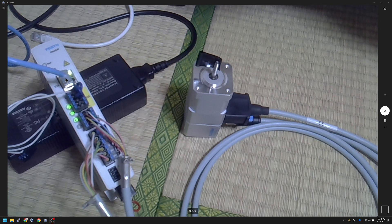There is a connection port here — this is a commissioning port. This allows you to connect your drive to your PC and use Festo's commissioning software to set parameters and create your servo project. The second one, labeled in yellow, is the STO signal terminal — Safe Torque Off. These two terminals connect to the servo motor.